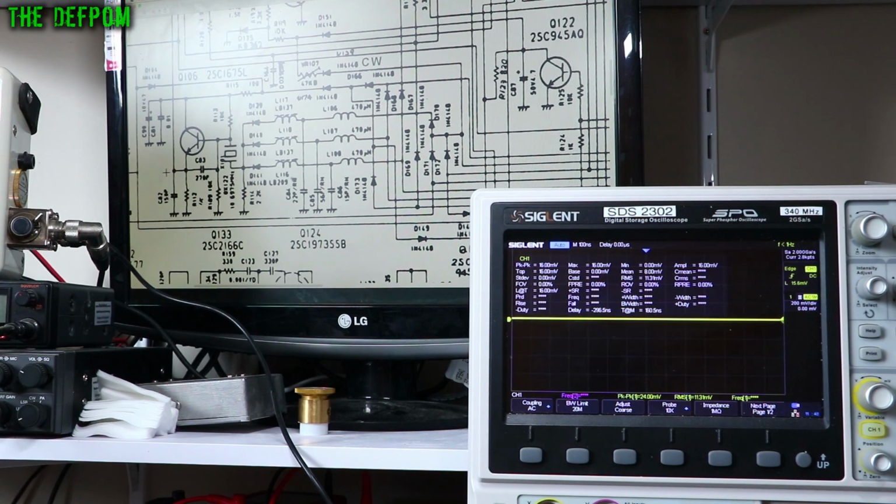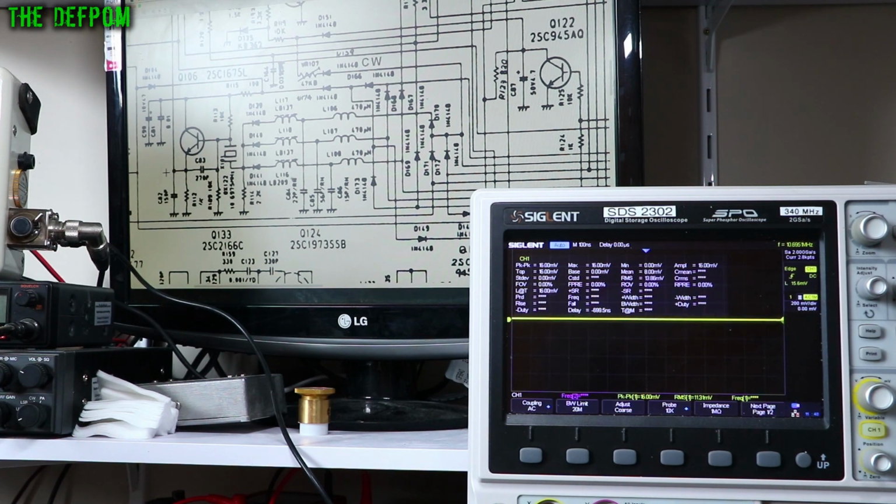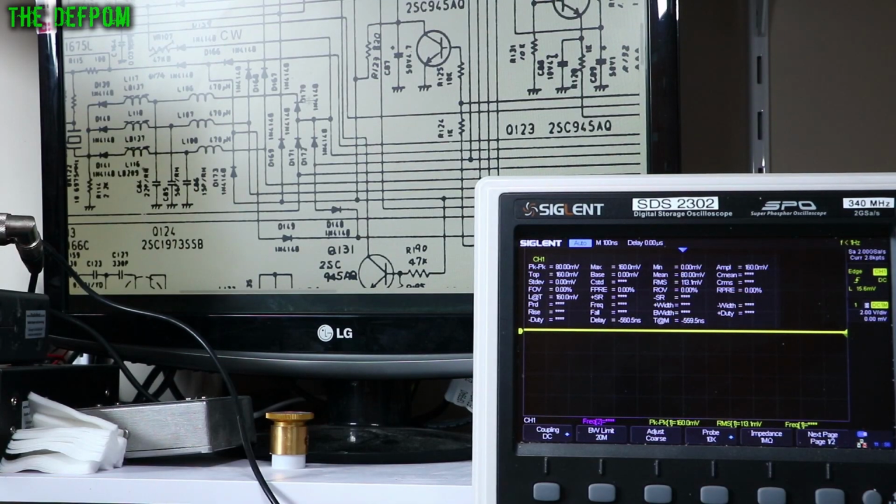This is on receive. Go to transmit on FM, it's there. 10.695, that's correct. Go to AM, there's nothing there. So the AM transmit, for some reason, it's not there. Well, that's curious. Let's check D70 here, or D170, which is supplying L106.